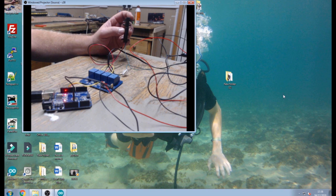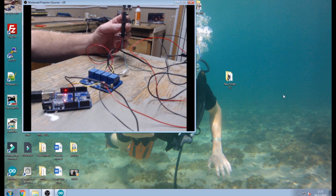These are priced at about £10 each. They're a bit dearer than the servos, but as you see in this demonstration they are a lot easier to set up, so there is an advantage to having them. Just a little note to say about these: these are only pulsed input voltages. You can't have a steady voltage on these because you'll burn them out. They're easy to burn out, and so with the JMRI they do provide a system where we pulse the output so they only pulse it for one second.